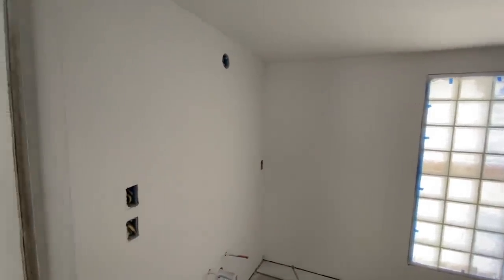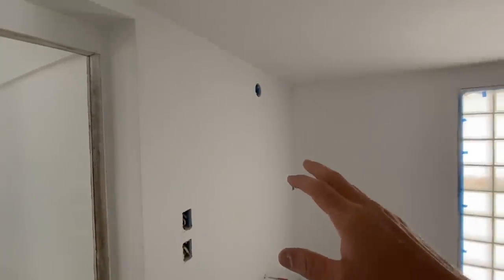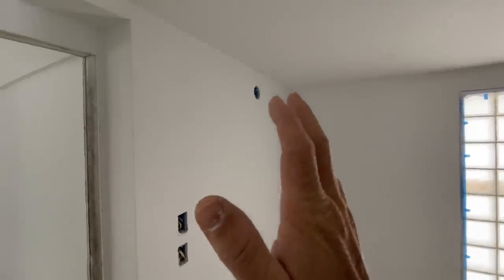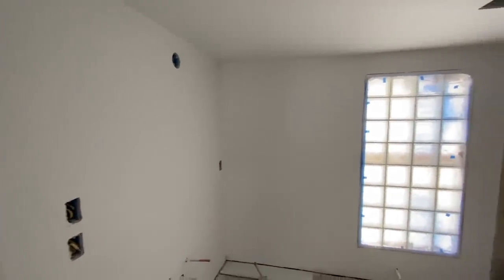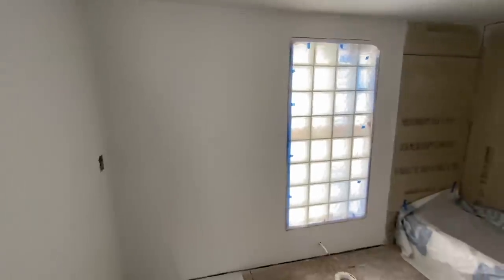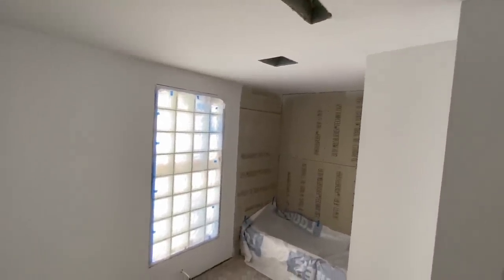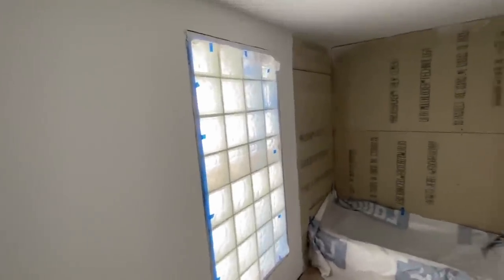I don't know if there is any point in doing that, but one of these bathroom specific mold resistant primers. But by putting this one down first, it's not going to eat up as much primer for the next one. So this would be sort of to seal it. The next one would be a higher quality primer and then using a high quality paint. Usually I use middle of the road stuff, inexpensive to middle of the road. But here in the bathroom, I think I'll go just a little bit nicer, maybe on the primer.